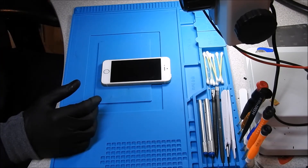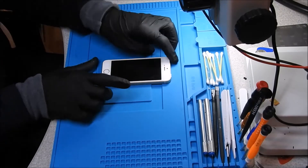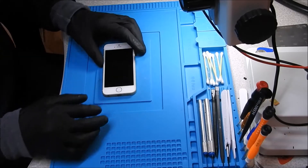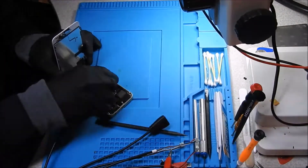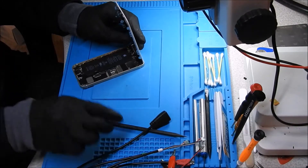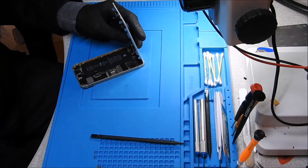Plugging it into power on the port-a-pow, we are getting a zero reading, so we're going to open it and see what the DC power supply says. Let's open it. Instant straight to 2 amps — we have a short on the board. Let's find it.